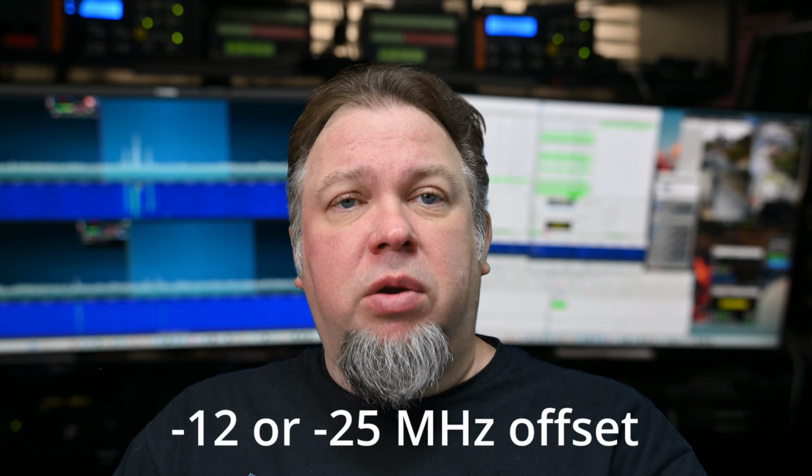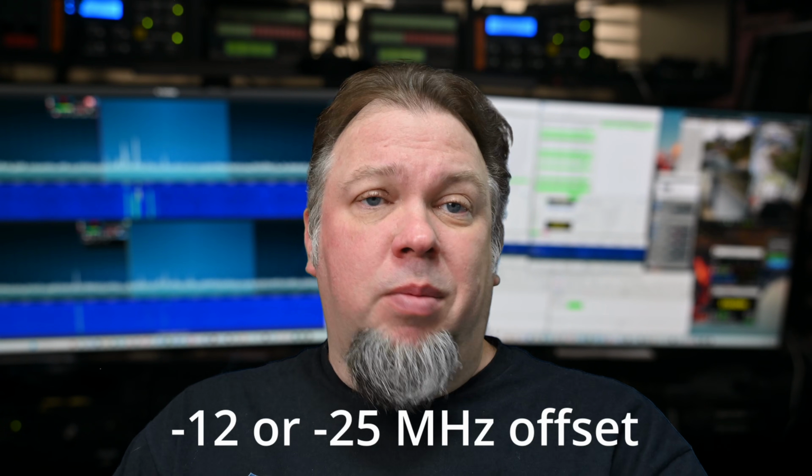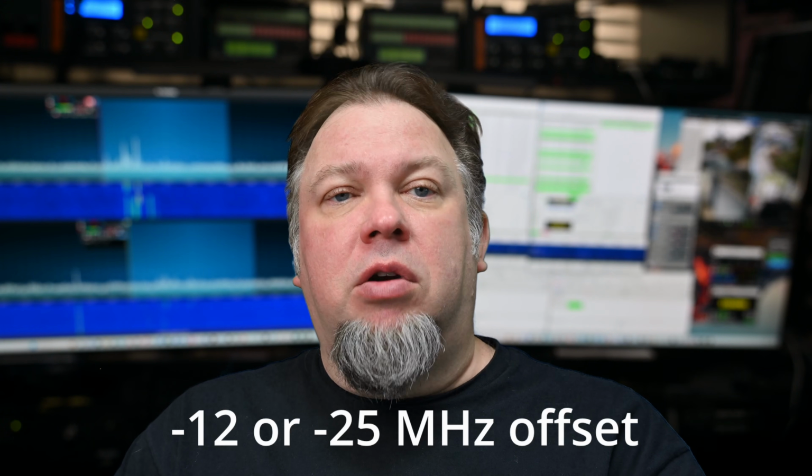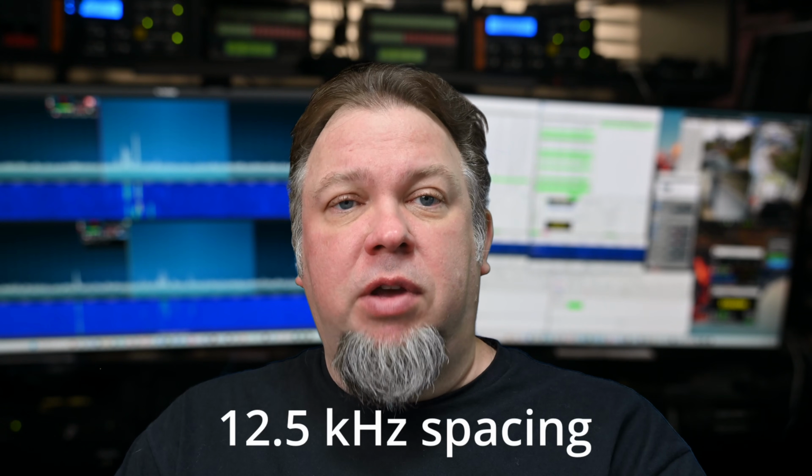If you're interested in this topic, let me know in the comments below, as I'm looking to test out my amateur television capabilities on my newly acquired ICOM IC-905, so I may just do a video on that as well. As a side note, at one point I was pretty active on analog ATV. The repeaters, depending on where you live, you may find a -12 MHz or likely a -25 MHz split or offset. Simplex frequency spacing in the US is 12.5 kHz.